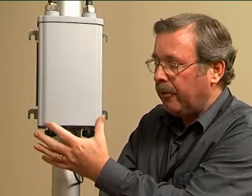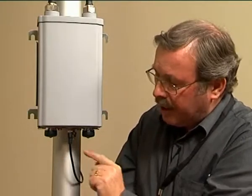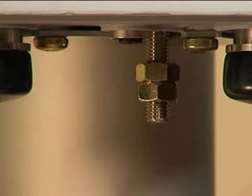All we have to do now is to connect the A and B branches from the ASC through the jumper cables to the feeders and onto the radio base station. Be careful that you don't get them mixed up. You also have to connect the earth connections from the ASC and the antenna, and isolate all the connections, sealing them all against the weather.